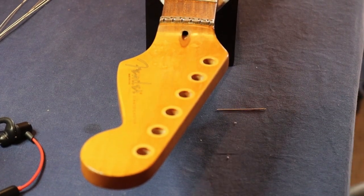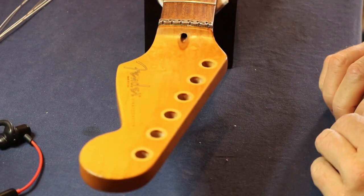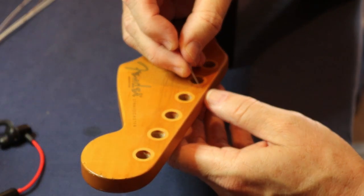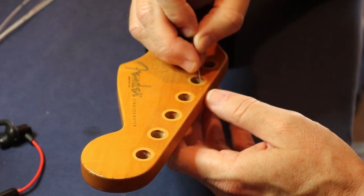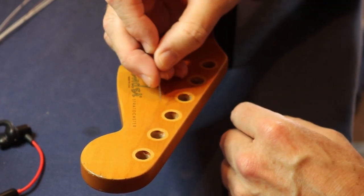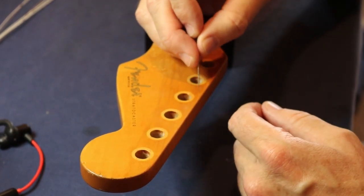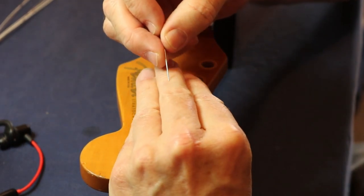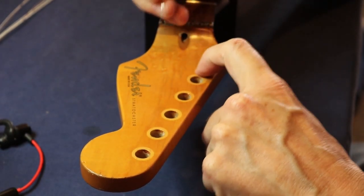Okay, back again, like Mr. Magoo. You see my glasses? I'm going to have to find a way. I'm using a needle to lift or make a slice, because I don't actually think, even though the lacquer's lifted, that it's split. So you have a lifted lacquer there, but it's sitting like a dome, so I'm going to have to slice open the dome somehow, get glue underneath it and put it back down again, without making a whole unholy mess.